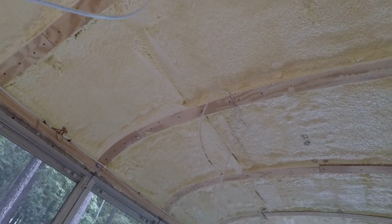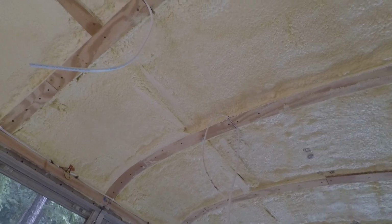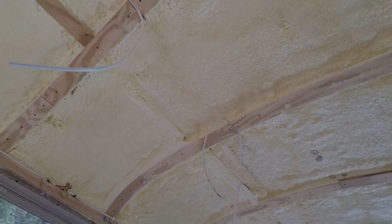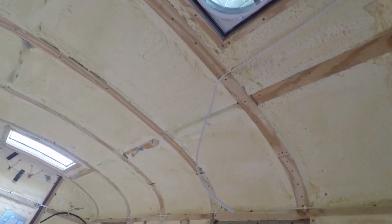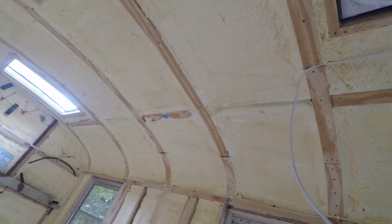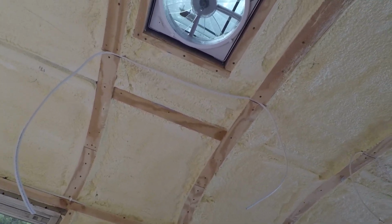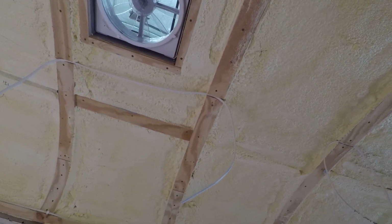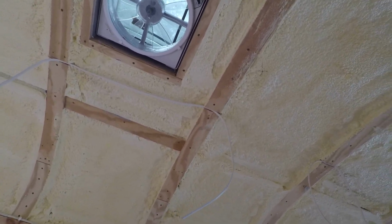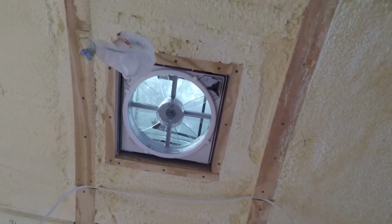They're not going to be dimmable because each light has its own LED driver that came with the lights, and they're not dimmable. I really couldn't find a 24 volt DC input, 24 volt DC output dimmable driver. They're all 120 volts input and 24 volt outputs, the dimmable ones. So the lights are not going to be dimmable.